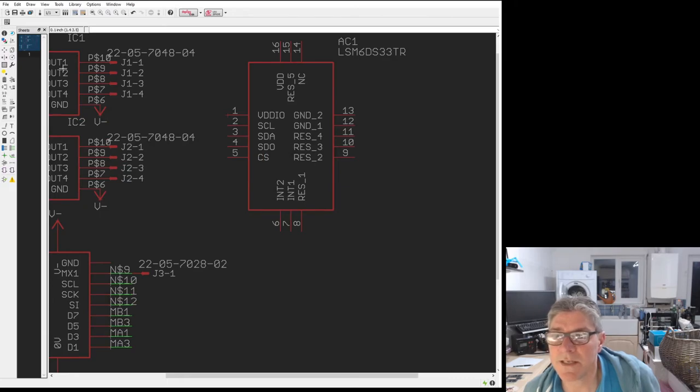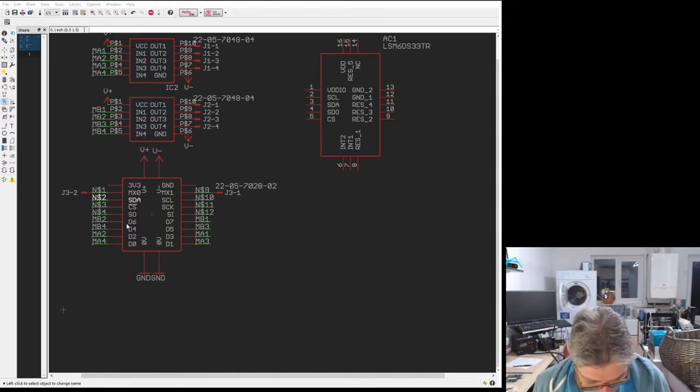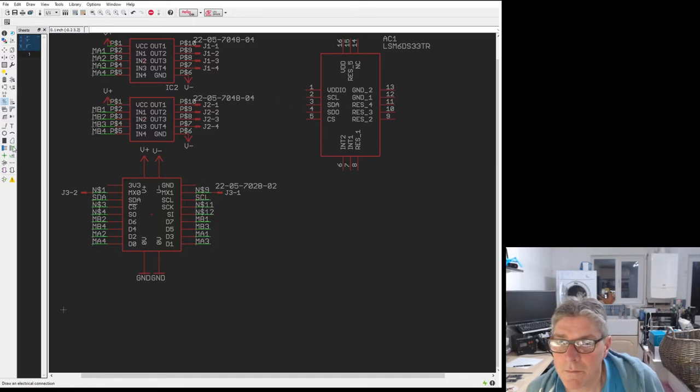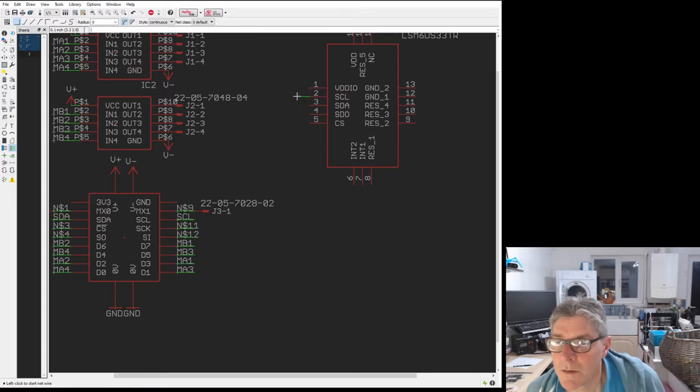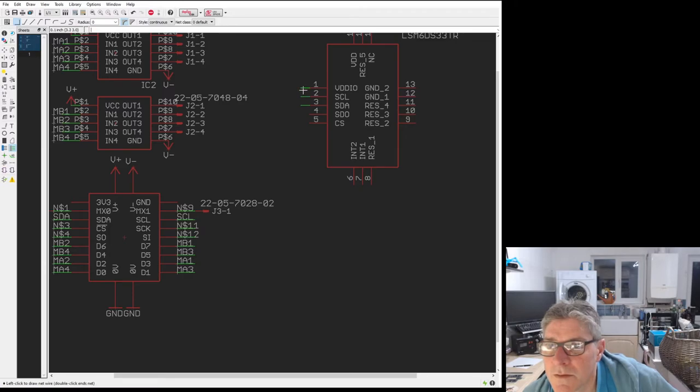So this is I2C based. Be more specific. So let's just do that. Let's add this in just for the moment. I'm not sure if this will be the right chip that we're going to use or not at this point. There's lots of different similar choices. In fact, this has got... So you can use this as SPI or I2C, you can use this for either. Interesting.